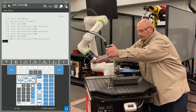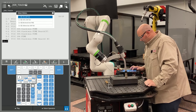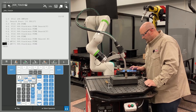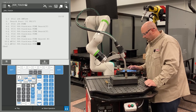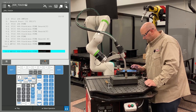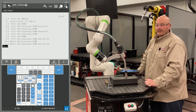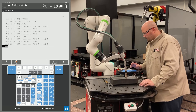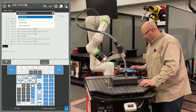That's my first X. Now I'm going to teach my second X. I'm going to bring the robot down to position for my second search, record two points in the same location, change the position ID numbers to match, cursor to the end of the line one point past FINE, press F4 Choice and select Search — searching X minus. A 2D with rotate requires two searches in two different search directions: I have two in the Y and two in the X. Now I'm going to tell the robot to stop searching: F1 Instruction, Touch Sensor, and select Search End.